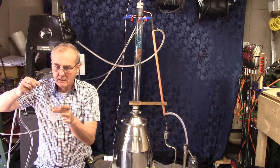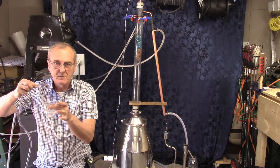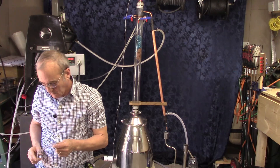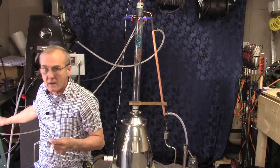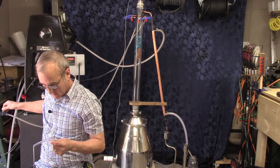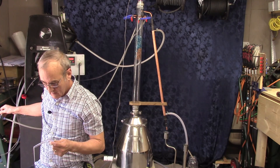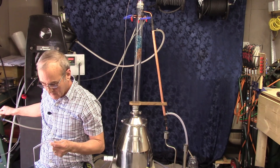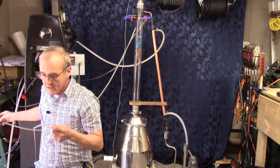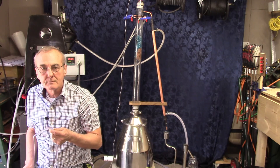You can see here how little is coming through there, and in my opinion just to start with that's probably a little bit too much. So I'm going to turn that down. That water flows just a little bit too fast for me. Here's my needle valve — there we go. Now you understand when I say it only takes a trickle of water running through your reflux chamber. That's what we're going to start with, and once we get it going we'll make adjustments.